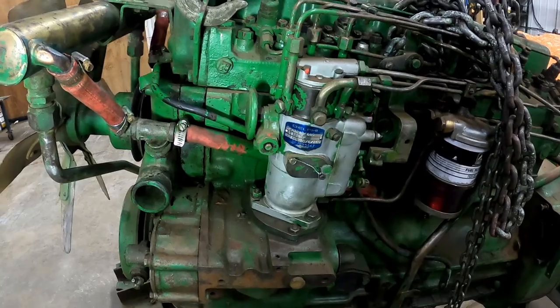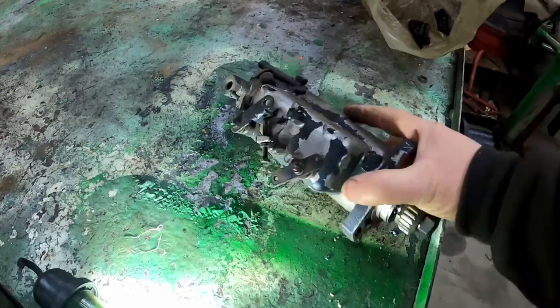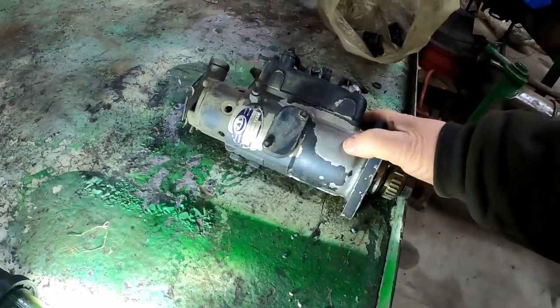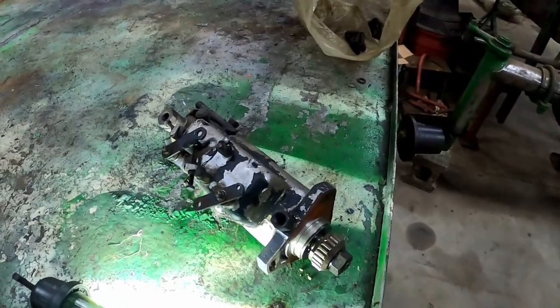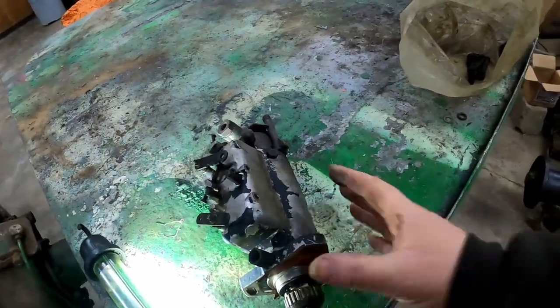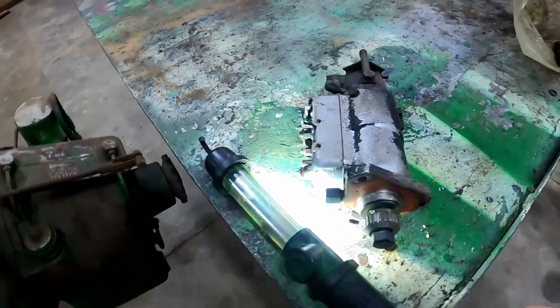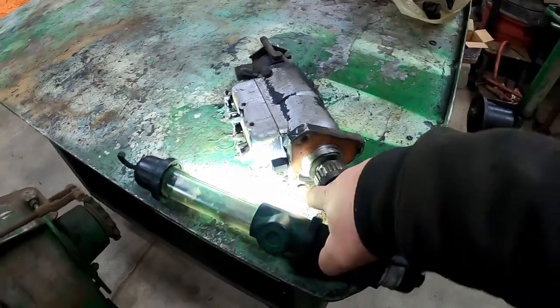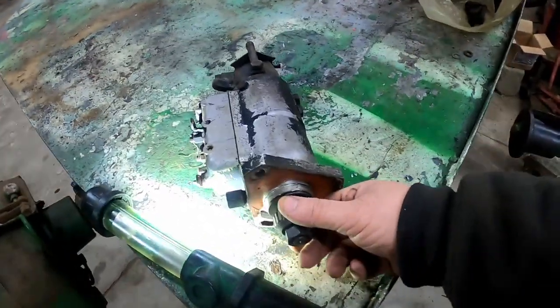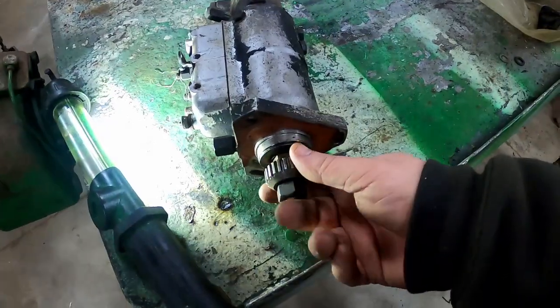You're wondering about timing — well, there's what's called a blind spline in there. Let me grab another pump. This is an injection pump — I don't remember if it's off a 285 or 2105 — and for the most part it's the same pump. This one doesn't have the diaphragm on the front like some of them did; there were changes. It mounts on pretty much the same way with the three bolts. One difference you'll find between this pump and the 1850 Perkins engine is this gear that's on here.